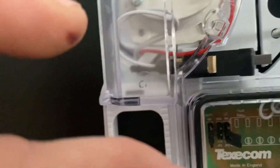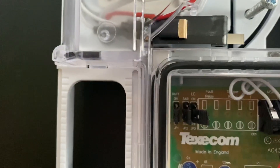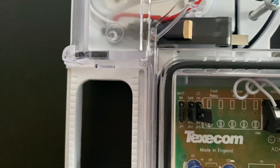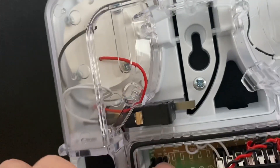It's quickly switched over by just removing the jumper and reinstalling it onto whichever mode you want. The bottom position is self-contained bell as it is now; at the top it's self-activated bell. You've also got low current mode here, so you can flick that, leave it on self-activated bell, and switch on your low current mode.